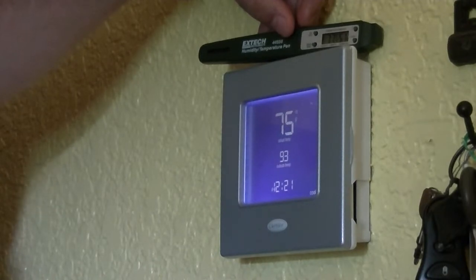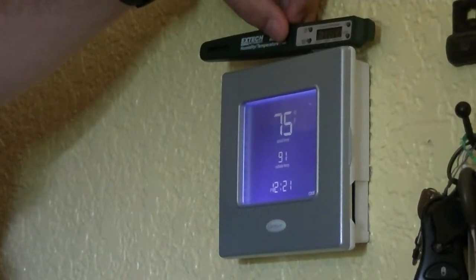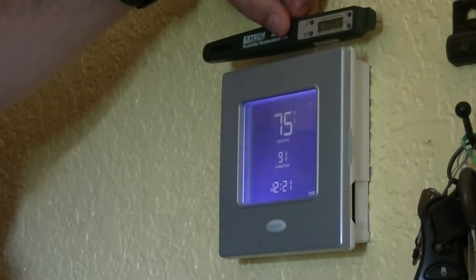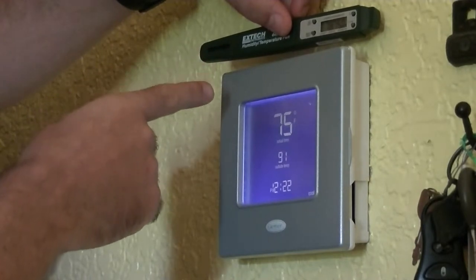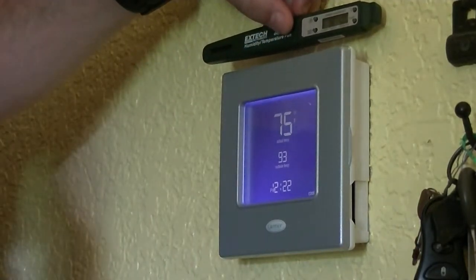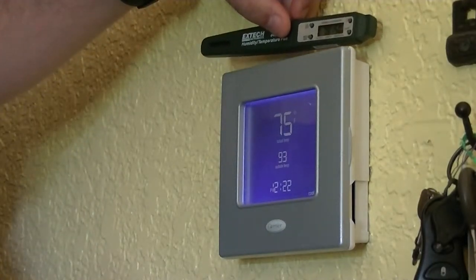As you wander around the room, take a survey. Also, despite being called a pen, these devices don't actually write — they're just shaped like one with a clip on the back. Do not put this in your pocket and wander around the house taking readings. The sensor would be trapped next to your warm, wet body and the humidity levels would go off the chart, giving you a false reading.